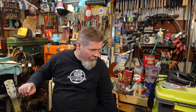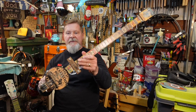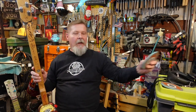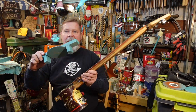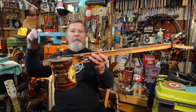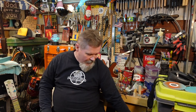Then I got into the world of coffee cans, and there's a lot to deal with on these. I want the seam up here where it's reinforcing where the controls go and all that. So I built a template — this lines everything up on the top of the can, this allows you to drill the holes for where the bolts go underneath, and this gadget right here allows you to put it on top of any can, line the can up the way you want, and it gives you the pocket hole locations to cut the can. I've got a playlist called Templates with a link for you.